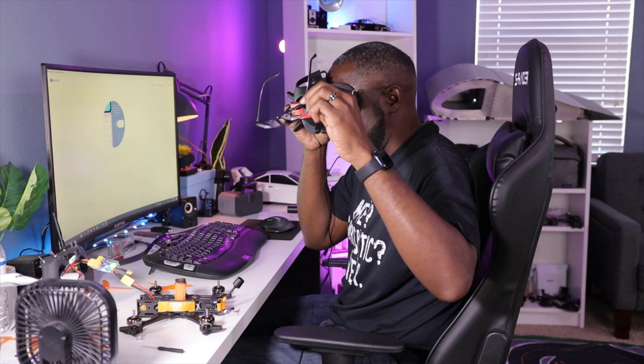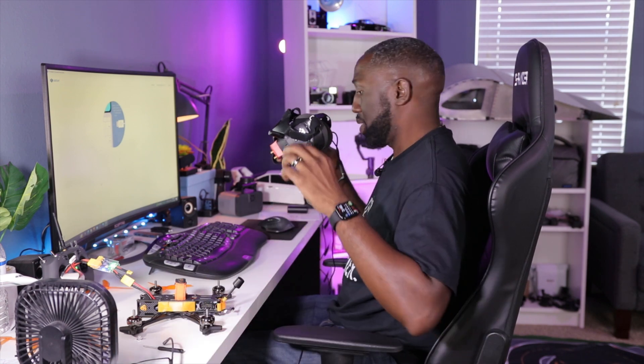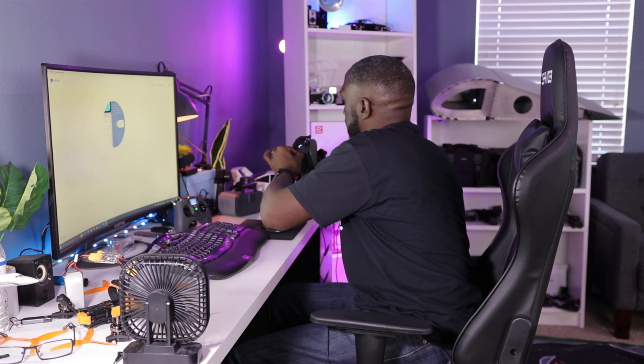I can see everything and I have OSD in the goggles. The key question is: can I record OSD? I start a recording — surprisingly it is recording. I can see all the flight information on screen. Stopping the recording and checking the file — it did record video. But there's no OSD file. It does not record OSD elements in the DVR. That's disappointing but it makes sense.